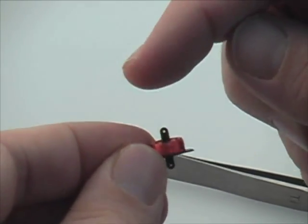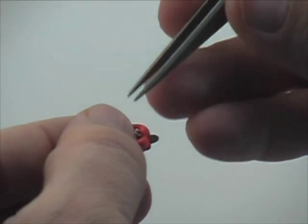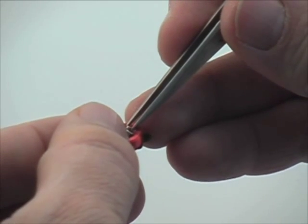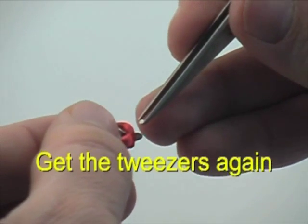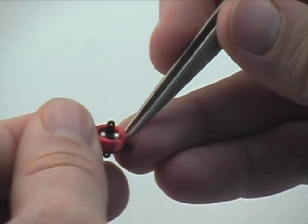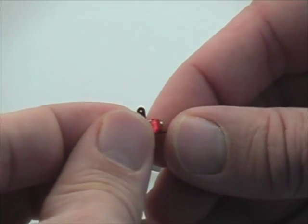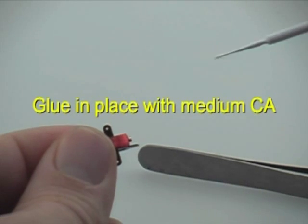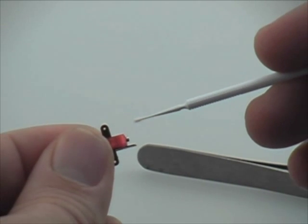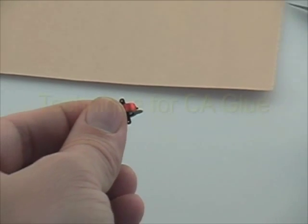You can see there's some motion there — and the same thing has happened again. You have to glue the magnets on before you're allowed to move the actuator. Get the tweezers out again, pull the small magnet off, and you can see how easy it is to put it on the outside. The position is not that critical really, but once you have the position, you want to glue it with some medium CA glue.